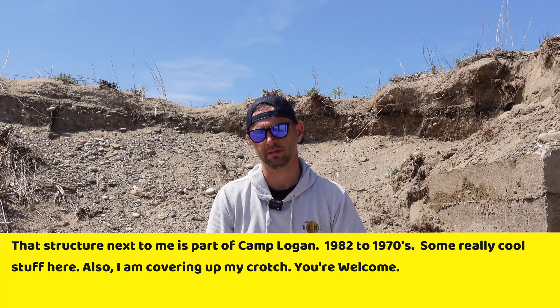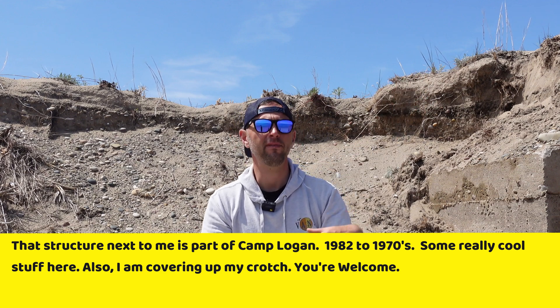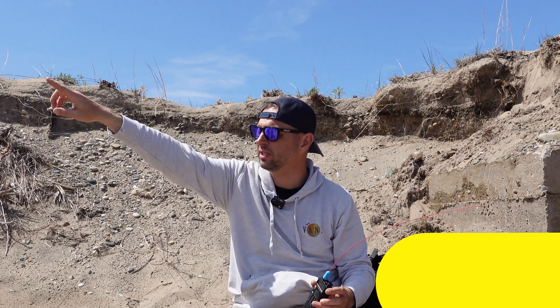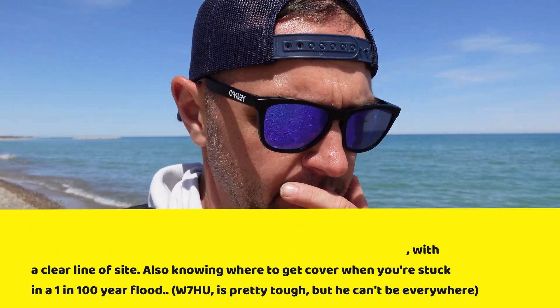This leads me into my next point, which is knowing your terrain. It's kind of part of being prepared — you need to know where you're going for your optimal communications. Here I am, I could see clearly to the horizon line, but how far is that? How far am I going to be able to contact and talk? What would happen if instead of sitting down here, I went up this small little hill a little bit? Height is might, and I might get just a little bit further out. I could see Chicago clearly, so maybe I could hit one of those repeaters and ask someone to try me on simplex, or maybe you have a beam. Knowing your terrain is a critical thing when it comes to great communications in VHF, UHF, and trying to activate with a cheap radio. Maybe that's the next thing we kind of discuss — taking your experiences and not only learning from them, but taking them as an opportunity to grow and to better improve yourself for the next activation.